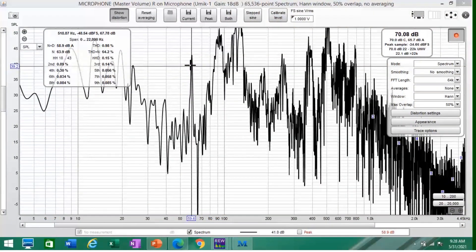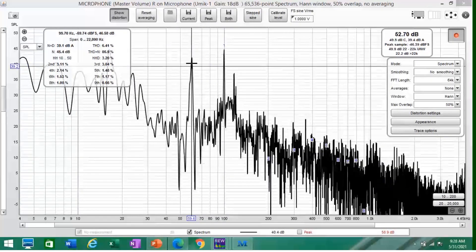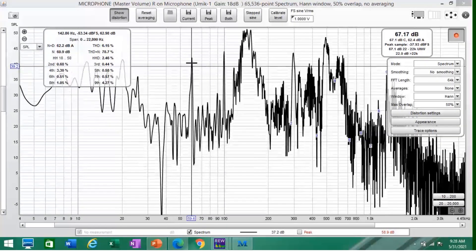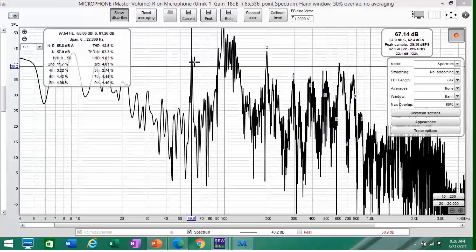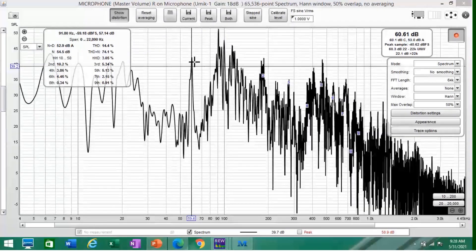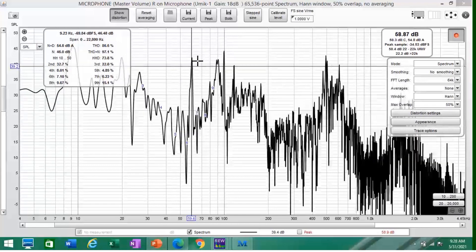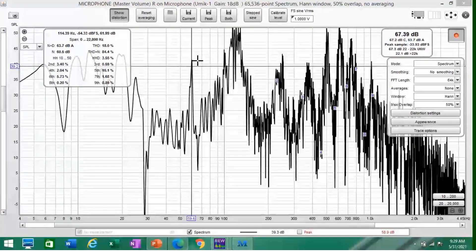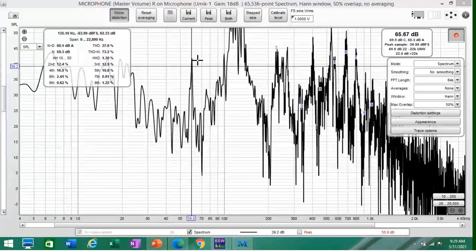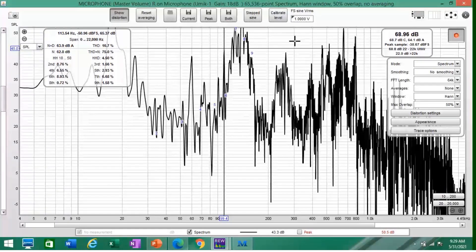It's picking up my voice, but we do see some peaks. We see one at 60 Hertz that's sustained, which is to be expected because in the United States electrical equipment is usually around 60 Hertz — that's a typical culprit. But we also see some noise at 99 Hertz — around 99.4, 99.6.